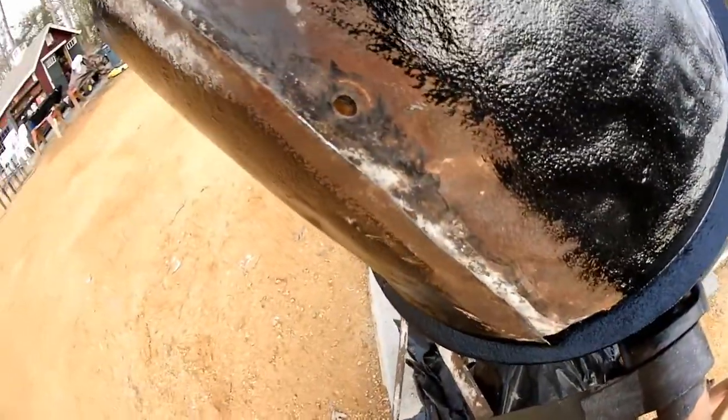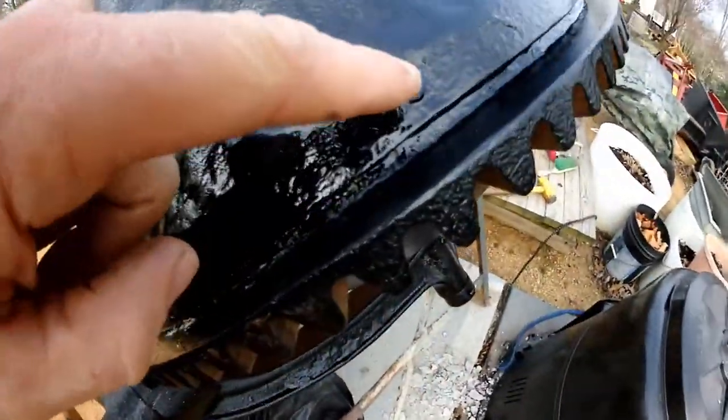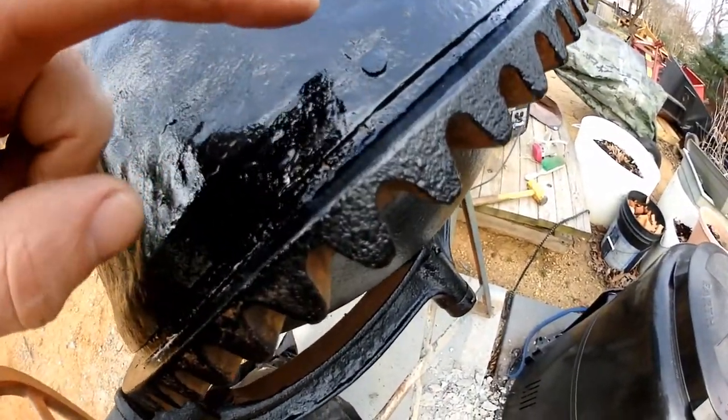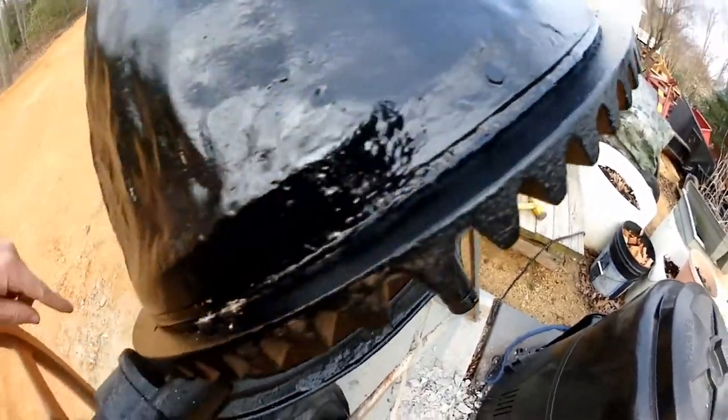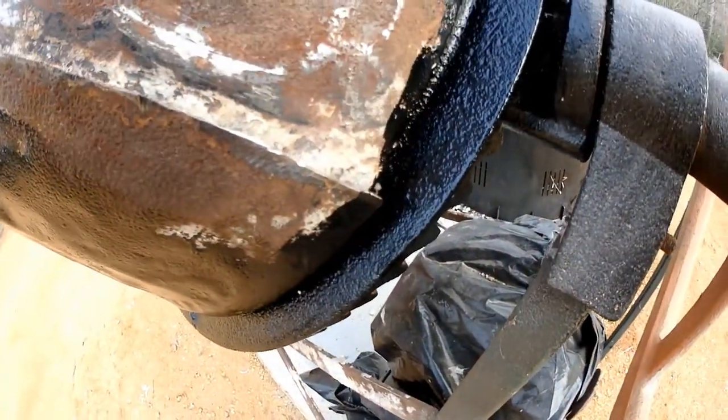I beat this one down pretty much, but when I did, this popped down here. This is just riveted on in a few places, because apparently this part is cast and this is steel, so I didn't want to weld the steel into the cast for obvious reasons. I'm probably going to have to drill a hole through here and put some small bolt through there.